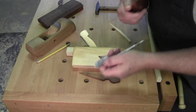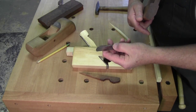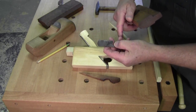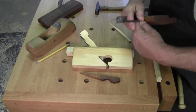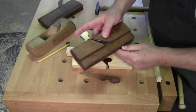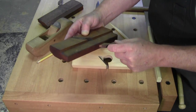If your iron is severely pitted you may need to make a new one. You can flatten them out and try to get rid of the pit, but sometimes it's really tough. These are called flags for the obvious reason. So you put your tapered iron back in the plane, put your finger here so you can feel where it's just barely touching, then put the wedge in.